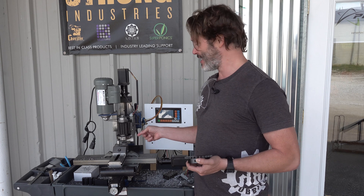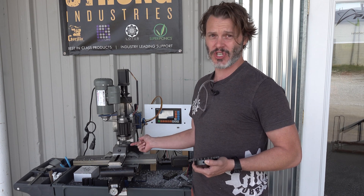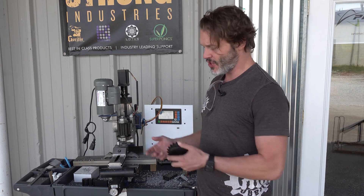Right now, the first thing we're going to do is bore out this chuck. I've already done most of the work, but we've got to bore the chuck out so that it will actually hold this. This is very standard for using lathes — you clamp down the chuck onto a small object or a ring so that when you actually clamp down onto the workpiece, the same force is used and the jaws are equal. Because if you don't bore them out with force, when you close them down there are concentricity issues that can occur.